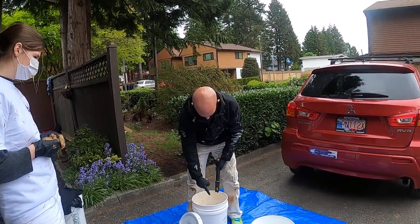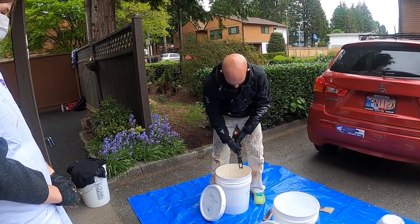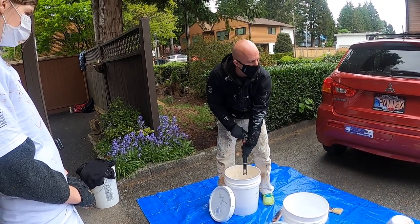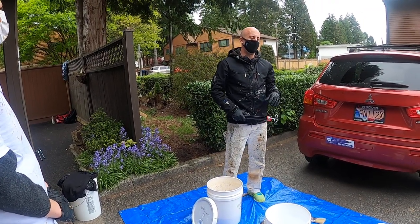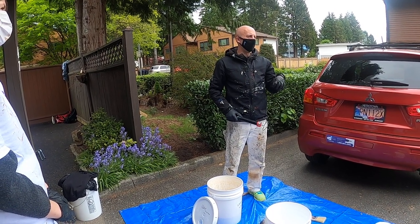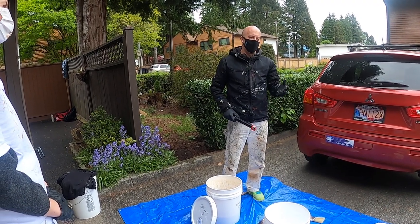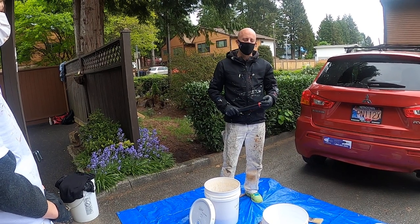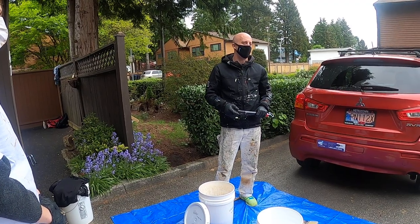Keep in mind: you saw what a brush can do for overspray. Imagine what a 20-mil roller is going to do on the spinner. So traditionally, have a drop sheet or a rag wrapped around it while spinning to catch any excess overspray. I only clean rollers that are in good shape and were used with very light colors — white or off-whites. For darker colors, you're not going to clean them well enough to be worth the time. Just make sure to wrap them up properly at the end of the day to reuse them throughout the entire job.